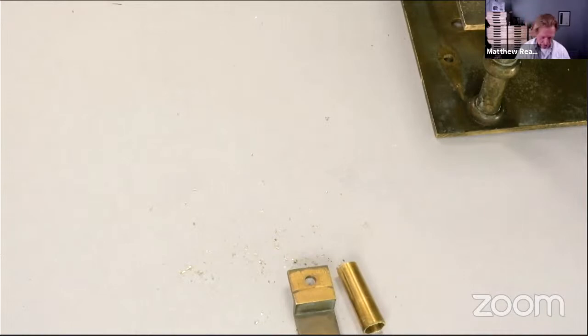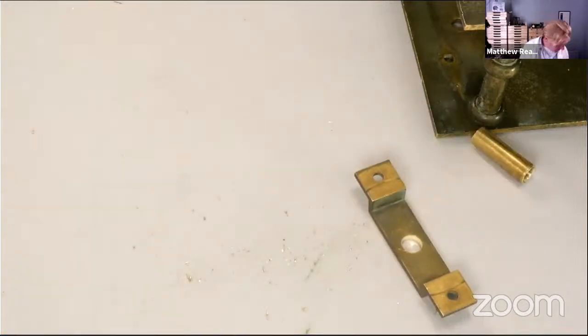Fiberglass pencil brush, just to clean up that edge. The edge is a casting that's broken, so it's really rough. So I think that'll actually help us. Again, fiberglass is quite hazardous, so you might want to wear a mask or use extraction. But yeah.